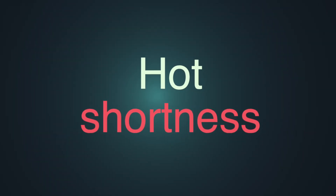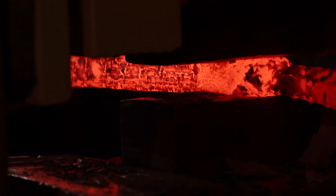So if you subsequently come and try to forge it, the grain boundaries infiltrated with copper become very weak. If you try to forge it out at high temperature, they break, and it's not good for the forging process. I can show you an example.